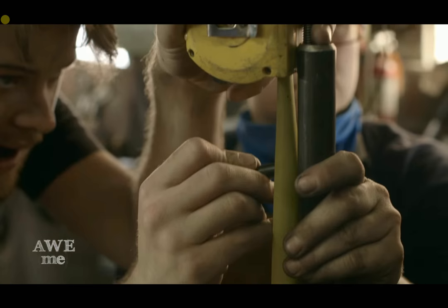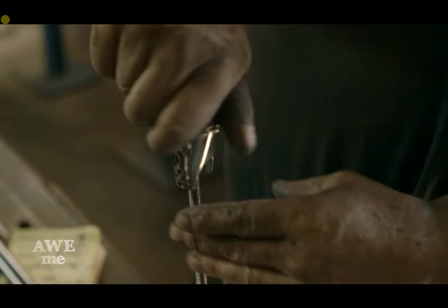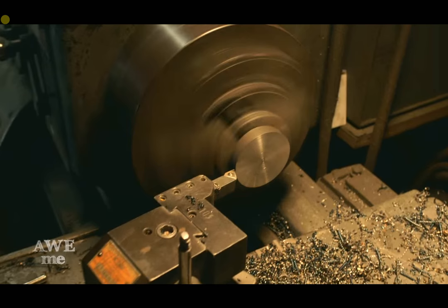I have a piece of steel pipe that sockets into the bronze pommel. The bronze pommel has a 3/8-16 thread hole in it. A piece of 3/8-16 all thread goes from the pommel up through the hammerhead to the top cap. And I have a crisp machined disc on the blade at the top that locks everything together.